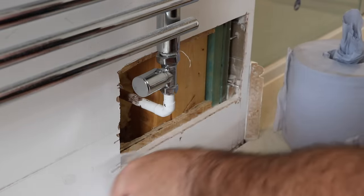Whether you're moving a radiator or in my case a towel rail, the process is essentially exactly the same — I'm just using less pipe. I'm actually moving this towel rail just 220 millimetres. Working in situ, I measure the various lengths of new pipe I need and work out the bends. It doesn't have to be 100% accurate because the connecting pipework running through the house is in plastic, so there's plenty of flexibility.